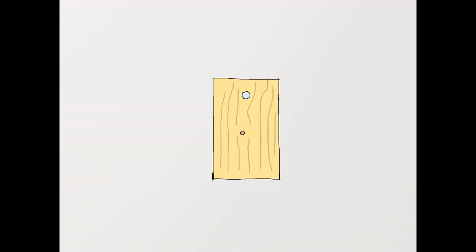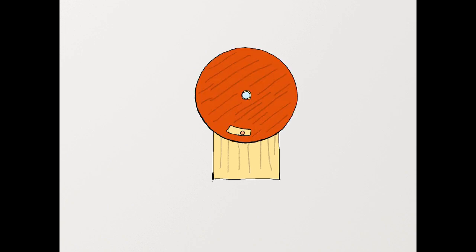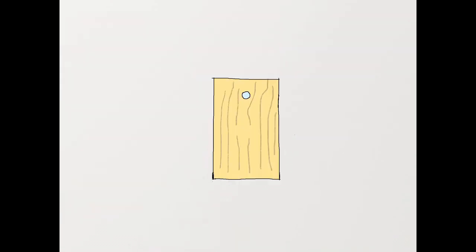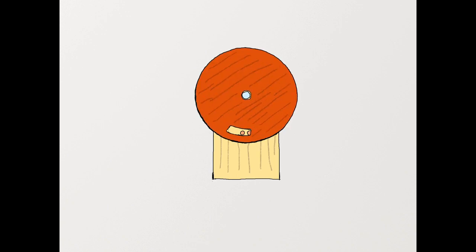My plan is to use a photocell that is alternately covered and uncovered by a wooden disc. That's pretty simple, but with only one sensor, the count would increase by one regardless of the direction. If I had to reverse directions because of a jam, the counter would lose count. However, if I used two sensors, I could sense the direction the disc is turning and decrement the count if I had to reverse the rotation.